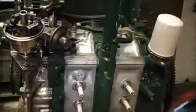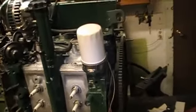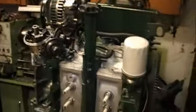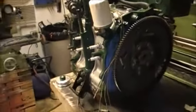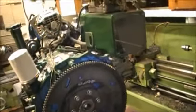I don't believe the guys that had this engine ever had it running in the car that I bought. The oil pan was full of oil and gas, and you can still smell it actually when you go into the exhaust and whatever. It still smells a little gassy. Compression's very good in it. I oiled it up before I even turned it over, and I don't know what the compression is. I just know that they're all the same and they're good and firm. There's nothing much leaking by, and I think it'll be good.